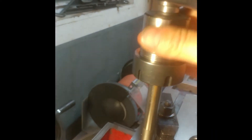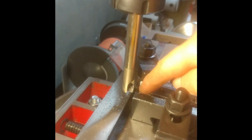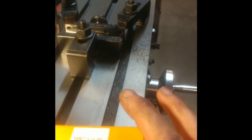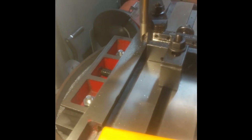The other tool I'm looking at — we just looked at the adapter I described, that's one of the tools I bought on Banggood. The other is this end mill. This is an insert type; it's got blue nano inserts which you can also buy on Banggood. This is a 14 millimeter diameter end mill. The full designation is 300R C14-14-150: 14 millimeter diameter and 150 millimeter long, which includes the portion going up into the collet.